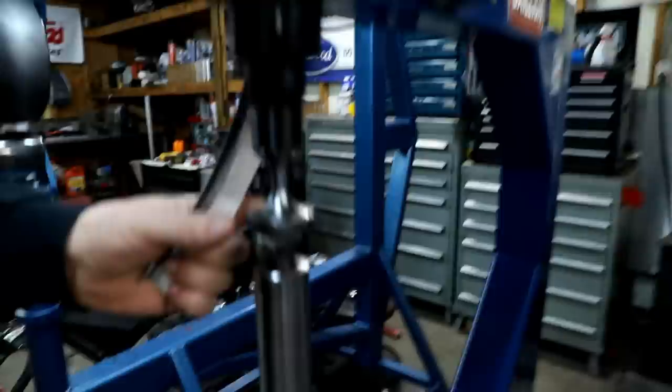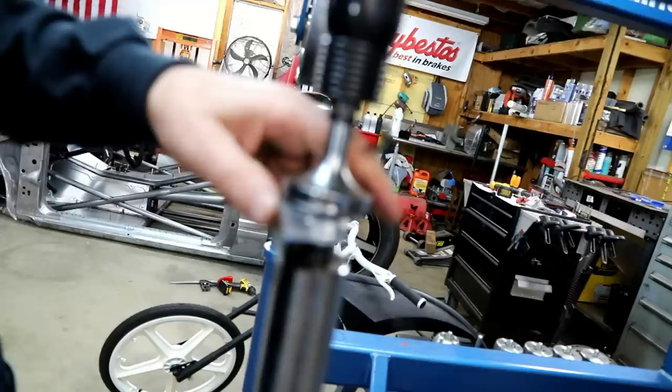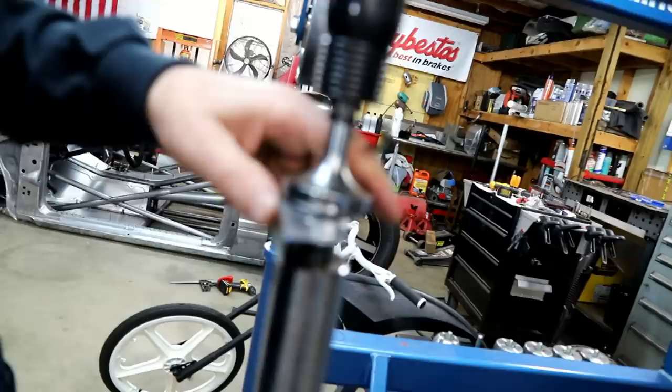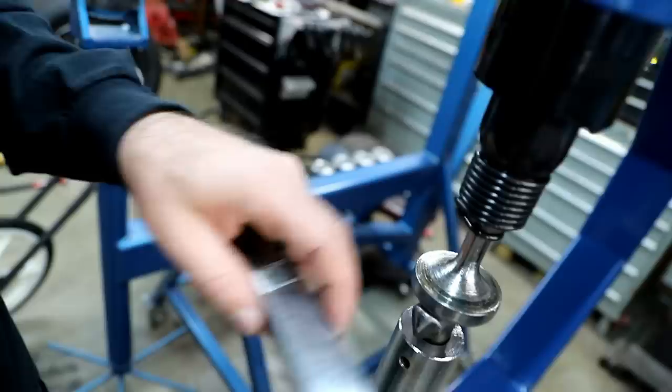So what I did was create my own die. I basically took some round bar and made a little tee piece. The nice thing now is this piece of steel or aluminum will fit all the way in there and it's gonna impact the metal all the way out to the edge. There's no big arc causing it to only contact on the outside — it's gonna contact all the way out to the edge. There is one key thing though: you do need a very slight arc to it, because if it's perfectly straight it's gonna try to stretch all the metal the same throughout the panel, and you don't want that.